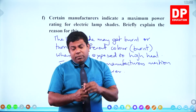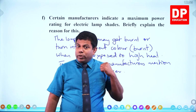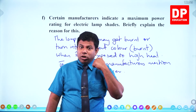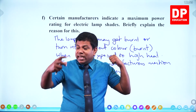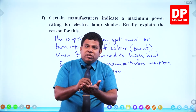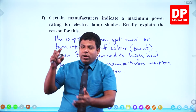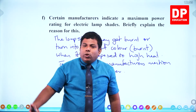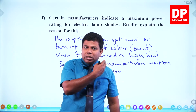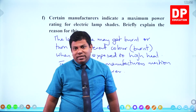Right? Sometimes in this question you might have had a doubt, why didn't we use a voltmeter, ammeter? Because the two questions we did, we didn't have voltmeter and ammeter. But the middle one, second one I did, there was a voltmeter, ammeter. Because these are bulbs where they have rated it. They have mentioned this is the volt. This is the power of this bulb. So we know, like when you are connecting it to the main supply, we know it's 230 volt. And they say it's this many watts. So since the ratings are known, you don't need a separate voltmeter, right?